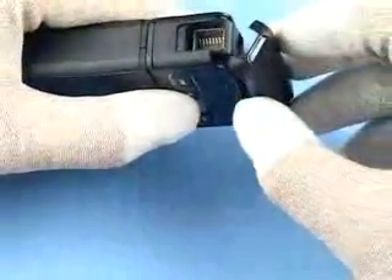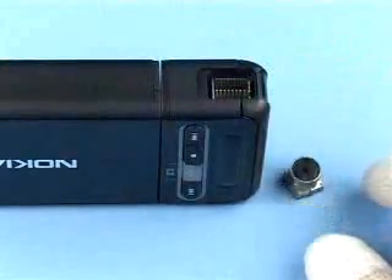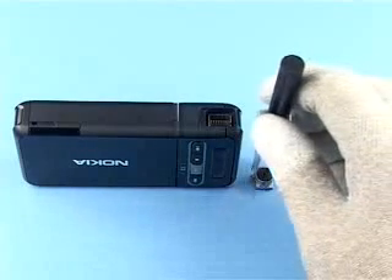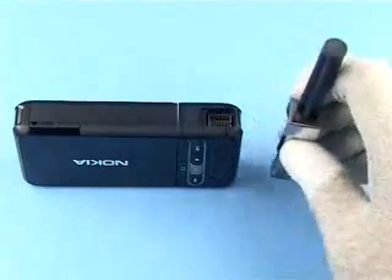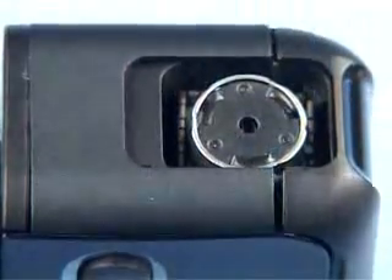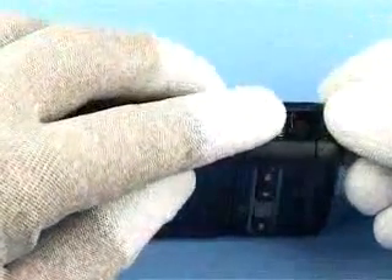Secure all the parts with the lower cap cover. Note the alignment key before positioning the camera. Insert the camera into its housing and push down evenly into place with the other end of the SS45. Insert the camera lens assembly and press it into place. Check the window for correct positioning and cleanliness.